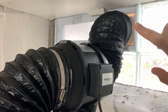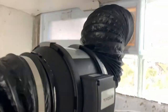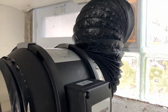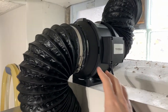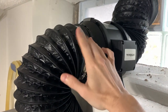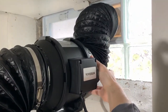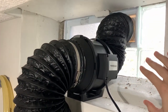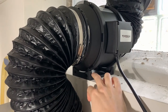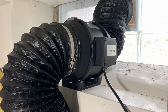We connected this to the already installed vent going outside — that was a four inch, so we had to use the reducer. It's hard to see but this is a six inch vent hooked up to the four inch reducer that goes outside. One tip: before you click in your inline fan, make sure to do the hose connections first, especially in the back if you don't have much room. I didn't have room back there, and once you click the fan in, at least for my model, I couldn't get it unclicked without cracking some plastic.